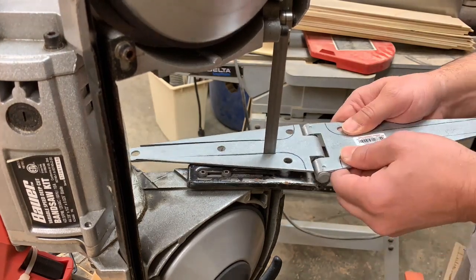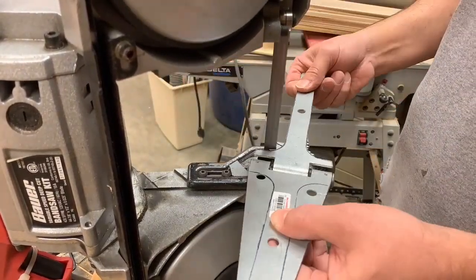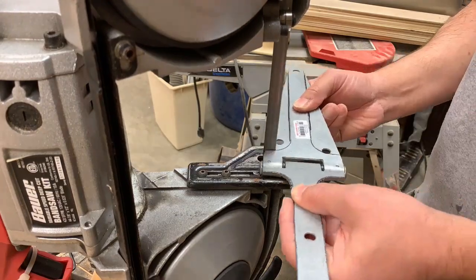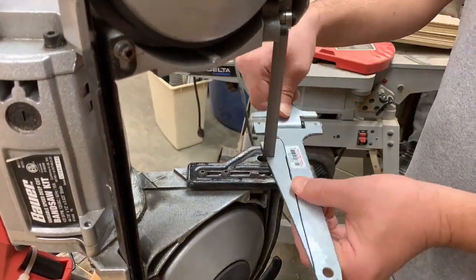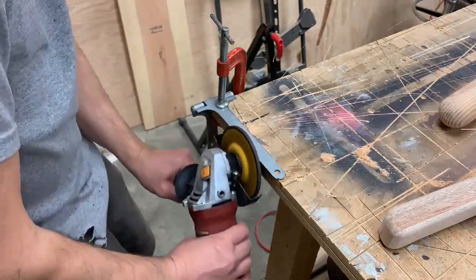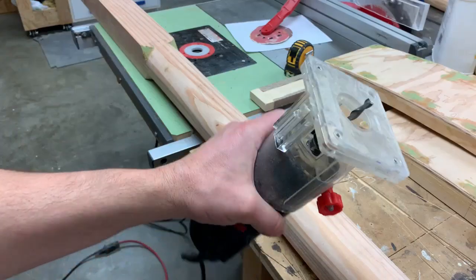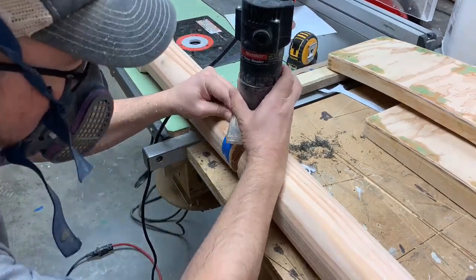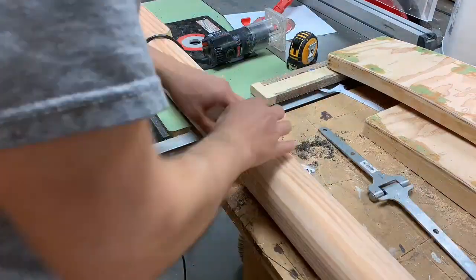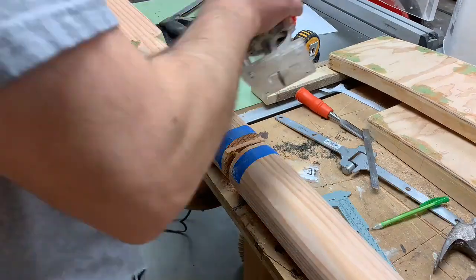As mentioned previously, this is a hinged mast design, so I'm going to modify this galvanized gate hinge to meet my needs. Because the mast is rounded, I was not able to utilize the full width of the hinge. The plans call for insetting the barrel of the hinge and the hinge itself into the mast. During the process of rounding the mast I had left a flat area on this side — I wish I could say that was intentional, it was not — but it did end up leaving a nice flat spot that I could rest the base of my router on to cut these indentions.